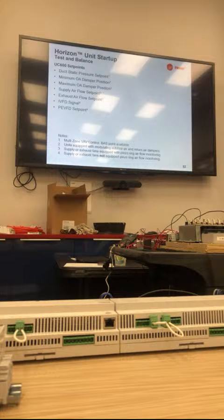If you look at the submittal itself, on the front page, you'll see supply airflow and then outdoor airflow. They should match if it's 100%. If it doesn't match, you divide by the 2 to figure out what you're getting. So for right now, my supply airflow says 9,000. I'm looking at the ME Stoughton High School one.